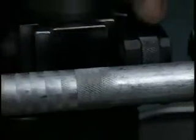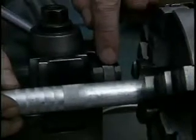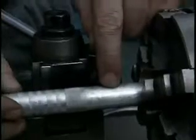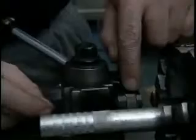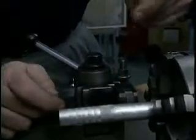Now, you will get this behavior, if you think about it, in almost every case, because unless the wheel diameter is a multiple of the diameter of the shaft, in one revolution, this tooth on the wheel won't come back to exactly the same place.